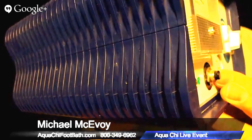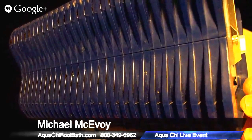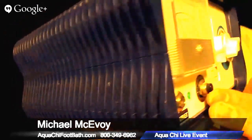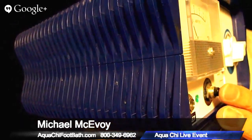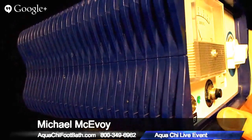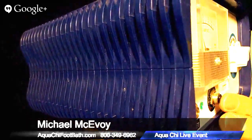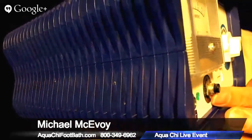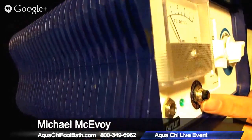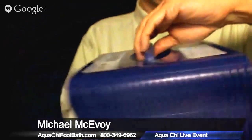This is the way it should be. If you did trip the circuit breaker, this would be sticking out about a half an inch or so, okay? And so it won't have this light-to-the-touch feel. It'll be sticking out, and you'll have to actually push it back in for it to click back in. All right, so this hardly ever blows, by the way, but sometimes it does, so I want you to be aware of that, okay? All right.